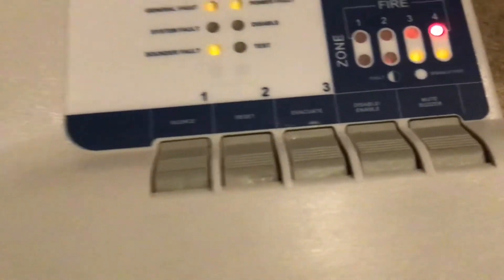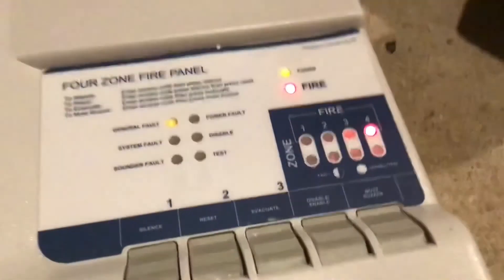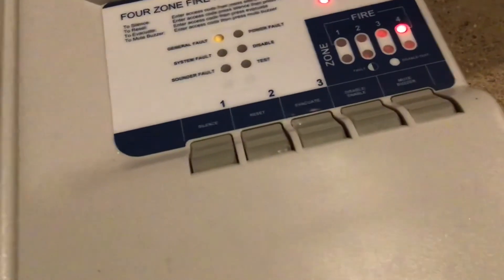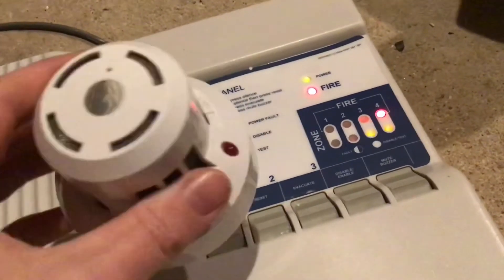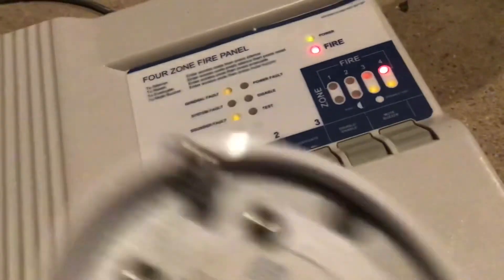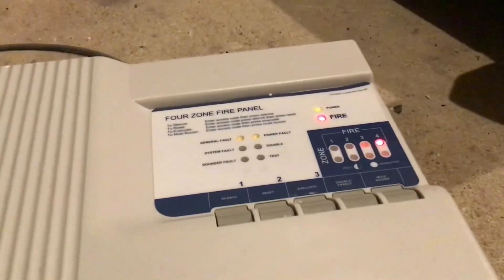That's pretty much it. I think this panel is decent and good. The only thing I don't really like is that when you're in access mode it does that irritating beep — most panels beep every 10 seconds and cancel after about 10 minutes, but this one is more irritating. Also I was going to try an Apollo Series 20 on it, but apparently the voltage isn't good enough — you need 12 volts and the alarm sense needs a different voltage to work on this panel. Shame really. Thanks for watching — please comment, like, and subscribe.